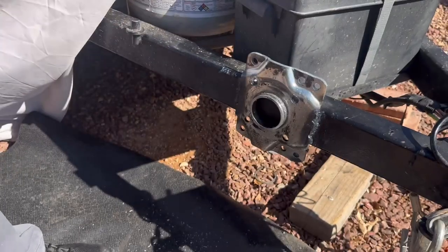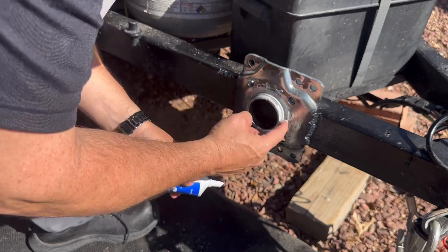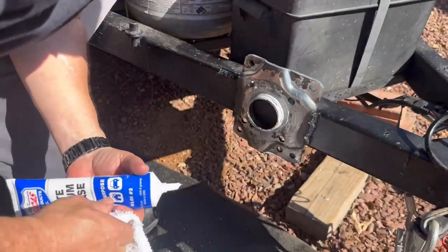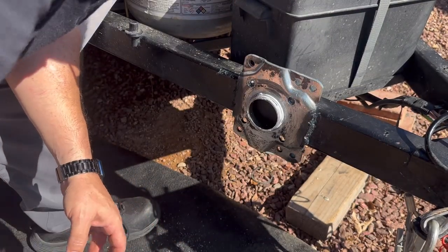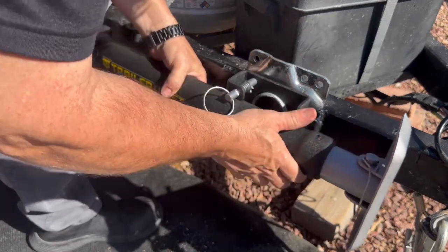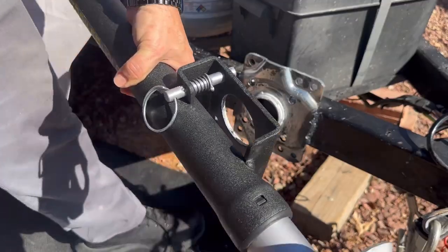I'm going to go ahead and put a little lithium grease just around this whole thing to help get that snap ring back in and also provide a little bit of lubrication around that ring. You don't want too much in here because this is definitely going to collect dust and actually hurt your chances of keeping it moving freely. But for installation it's going to be helpful. I need to go grab a clamp to hold this thing up where I can work on it.